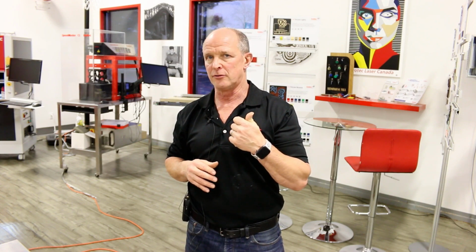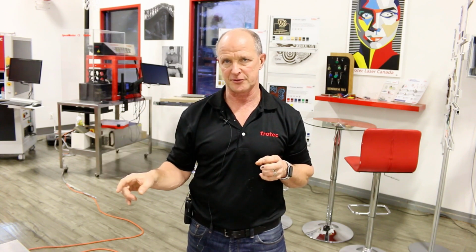Don't just look at something and say, yeah, it's going to go into the corner there. Think about if we're doing more than one, if we're doing 50, how can I make it quick so I can just put a piece in there and press the repeat button. If it's just a 7x9 plaque, I can just stick it up in the top left-hand corner and then press go and off I go. But if I'm working on a rotary attachment and I want to put the next one in and be in the same spot in terms of the start point so that I can just press the go button, it requires a little bit more thinking.